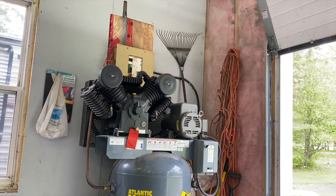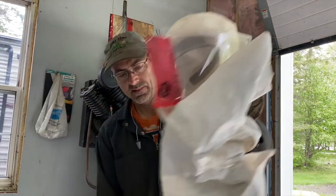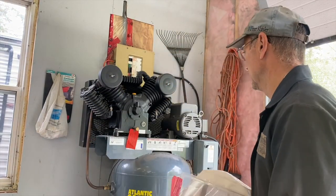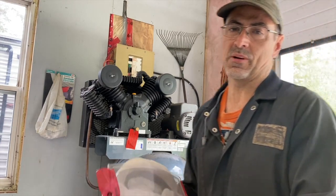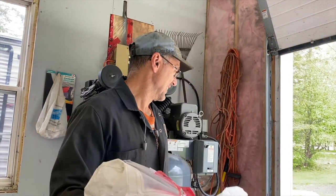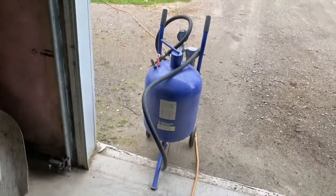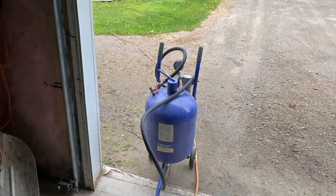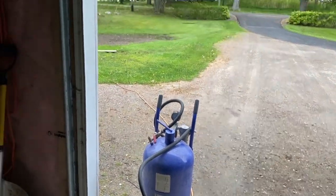Now, if you don't have a big compressor, you need to have an adequate air supply — air supply for your hood too. I have a 30 CFM compressor at 150 PSI and a pressurized sandblaster that works really well. You can buy them at Harbor Freight for around 100 bucks. If you don't have all the equipment, just search for sandblasting services around your area, bring your mower deck in, and that's it — that'd work really well.